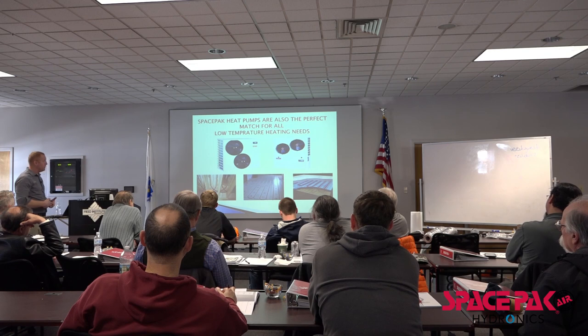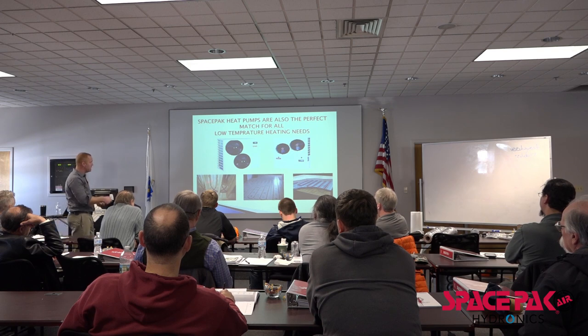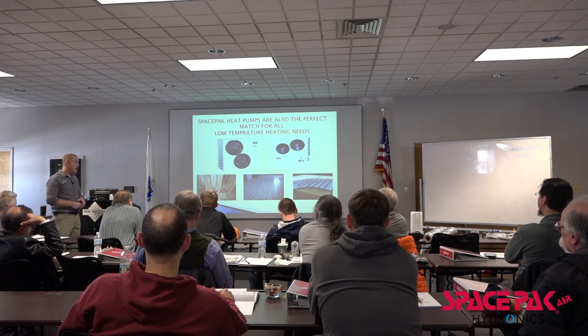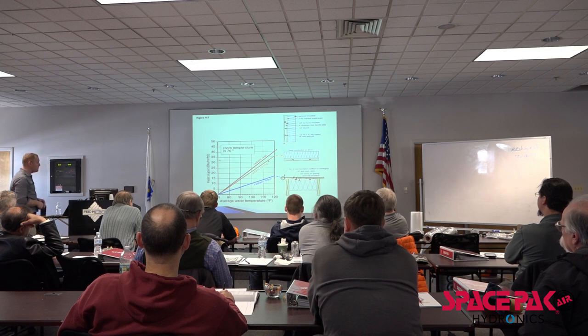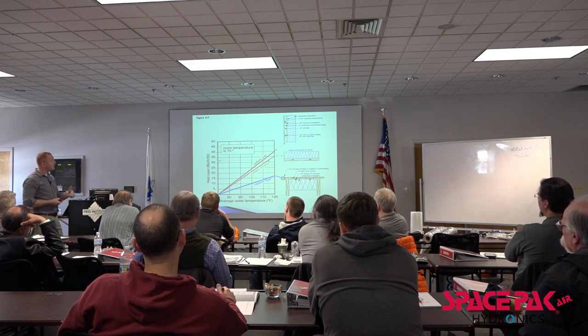Our heat pumps, chillers, are also a great match for our low temperature needs. And what are our low temperature needs, besides our fan coils? Anybody's radiant, right? Again, we're making really good efficiency outside, and we're chilling down water, and we're heating up water. So we can see where our temperature ranges are. Generally, we could use a radiant wall, we could use radiant ceiling, and we can use radiant floor, all in these different temperature variations.